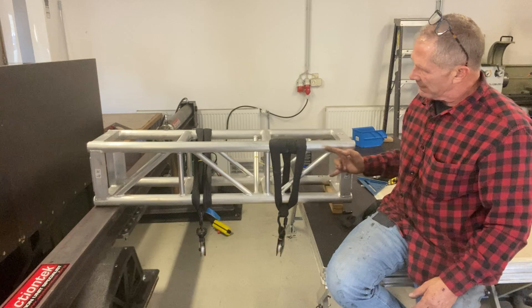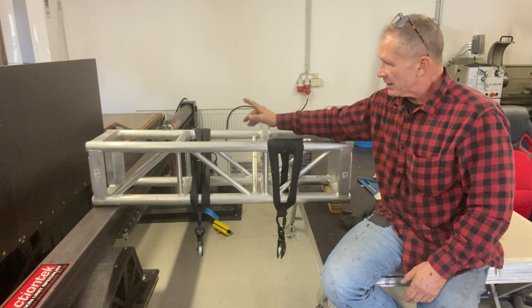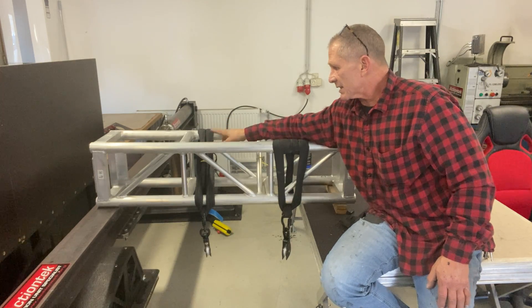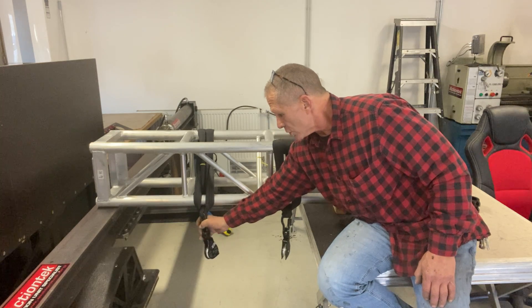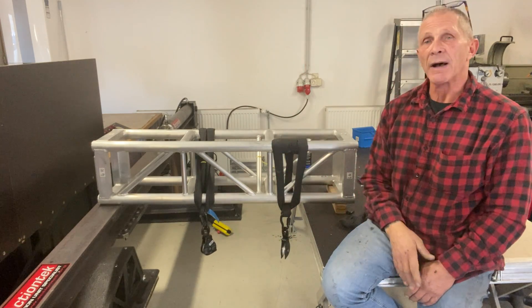I've got this ladder beam side of the truss supporting this. This will work well. And this one's a diagonal — it's the same concept but done diagonally. I don't need to take an extra wrap because the diagonal distance ate up what I used in the wrap here, and I still have a very short choke here. Again, it's back pulling — back choke against it, so it'll tighten itself up.